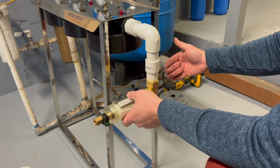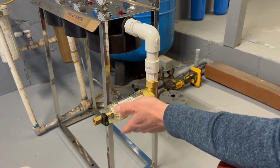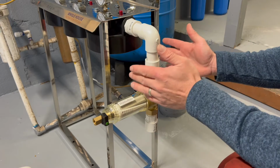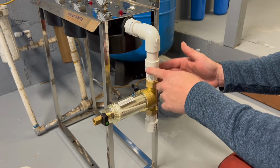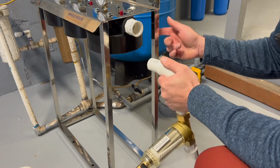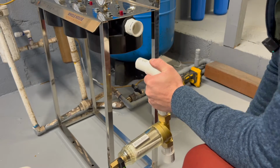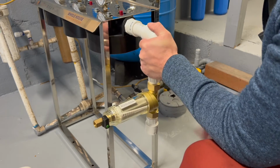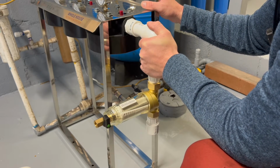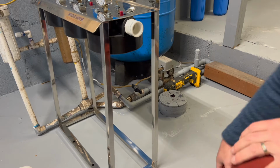I think that way I'm gonna get to exactly where I want to be and everything would still work pretty good. I think it's now time to cut the water lines, move out all the old pipes and kind of get the fitment of where we wanna secure this. So I'm gonna get it in place before I glue this in, just to make sure everything lines up, kind of like dry fit it before I actually glue it in. Because once it's glued in, obviously it is fixed and no going back from there. So let's cut some water and hopefully we don't have a big old mess.